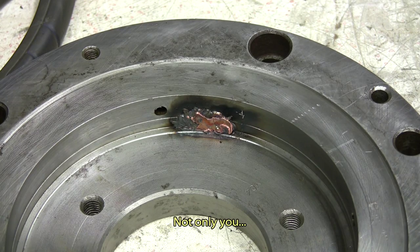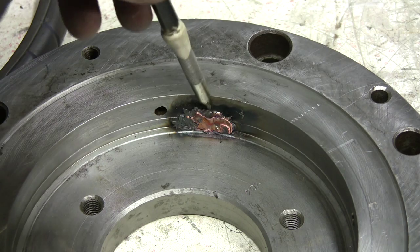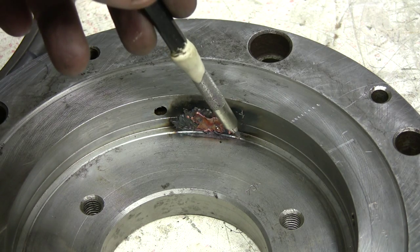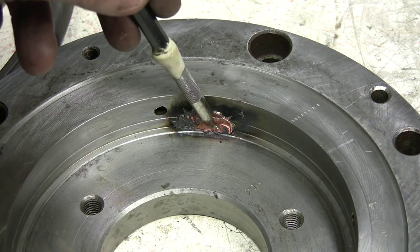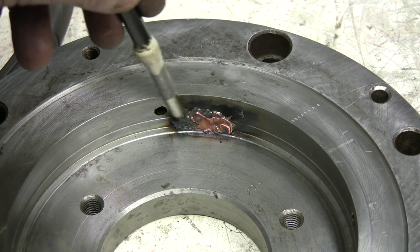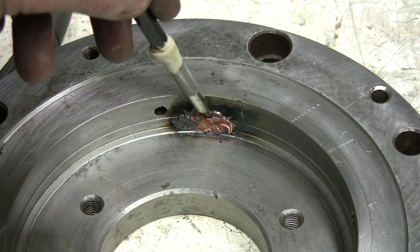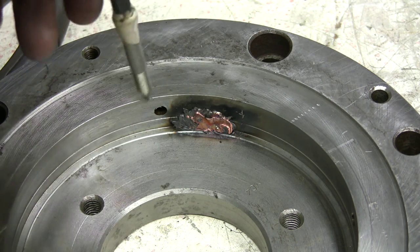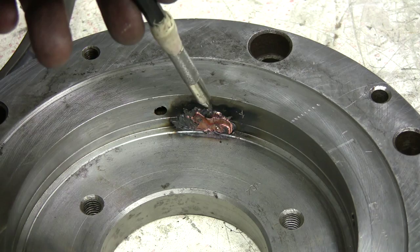Here, for those of you who were wondering what would happen in the back after those first two welds, see, there's a little bit of copper left right there. It's only normal because it will stick a little bit, but the copper was mostly used as a backup so I would get a decent surface in the back. It helps shield the weld with the argon, that won't go too far. And also mostly the purpose of copper was to pull out the heat as fast as possible.